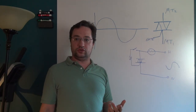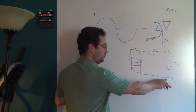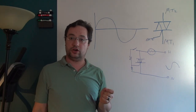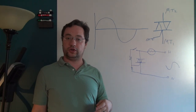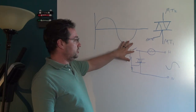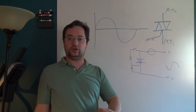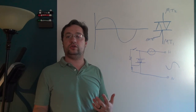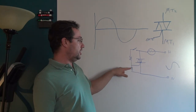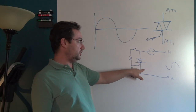The way to improve the circuit slightly is to add a resistor down to the neutral side. What this resistor will do is make sure that the triac does not inadvertently trigger from spikes in the AC wave and general noise when the switch is open. When the switch is open, the gate is floating, and a floating terminal on a silicon device is generally a bad idea. So you tie this down to the neutral side to make sure that spikes do not cause the gate to go above or below the polarity of the MT1 terminal.